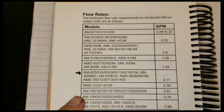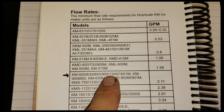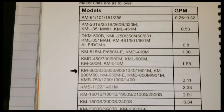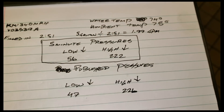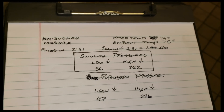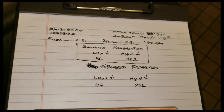Our flow rate — we're working with a KM-1340 MRH, so we need 2.11 gallons per minute. I calculated us at 5 gallons divided by 2.51 minutes, which equals 1.99 gallons per minute. That doesn't sound bad; I'm not going to fault it just for that. The refrigerant pressures were a little funky on the low pressure side — a little high — but the head pressure was in line. That's why I was checking those expansion valves to see if I was flooding. Everything's looking good so far.